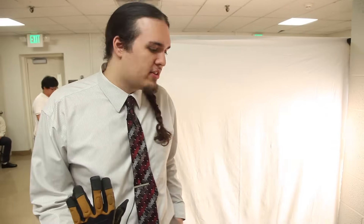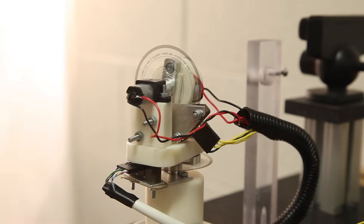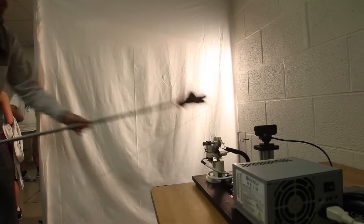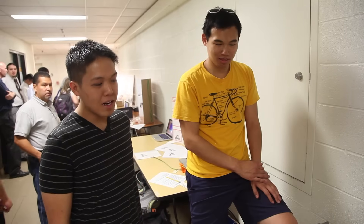This is our ME 102B project — a laser tracking system. It uses an image processing algorithm combined with a two-axis gimbal that we designed to keep a laser on top of a target while it moves, including through fast motion. An application that was brought up to us that we hadn't thought of was particle flow velocimetry, which is where small particles in a fluid flow are measured to track streamlines.